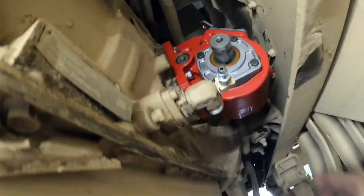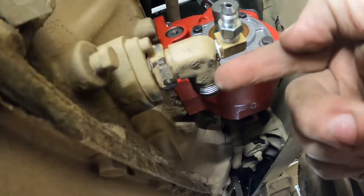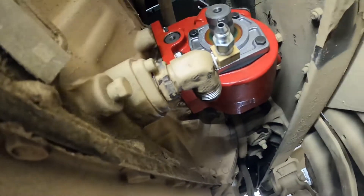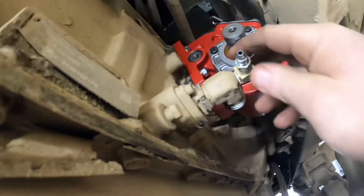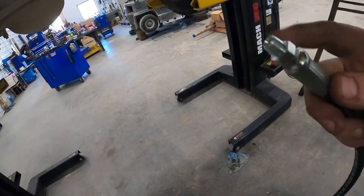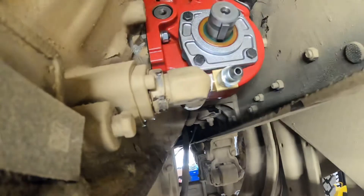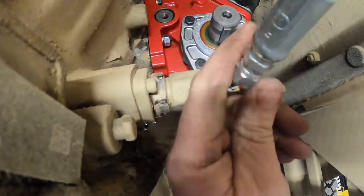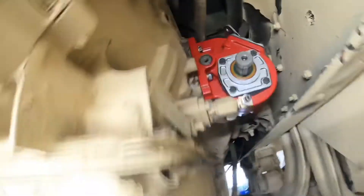Showing this fitting — I drilled and tapped the transmission cooler line. After 40 of these I still tapped it on the wrong side this time. We drilled it with a 7/16th drill bit and tapped it with a quarter-inch MPT pipe tap. Then I put a street 90-degree elbow on there with thread tape. The hose that comes in the kit has eighth-inch pipe threads on one end — use thread tape — and threads into the PTO first. The other end goes on this fitting, supplying low-pressure oil to lubricate the gears inside.